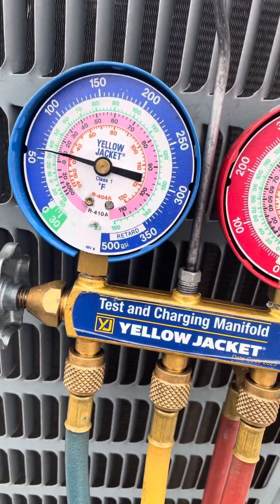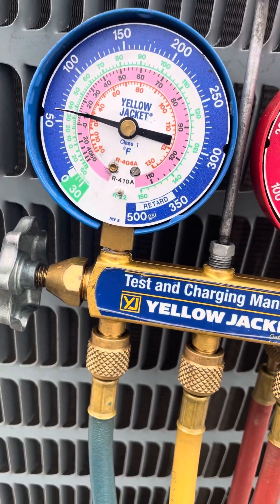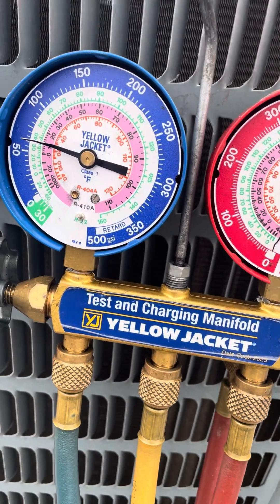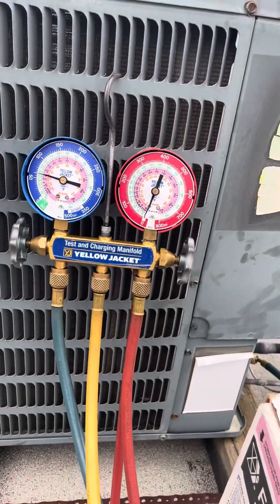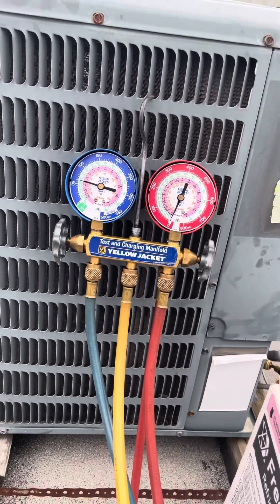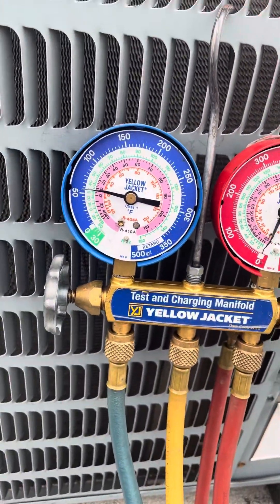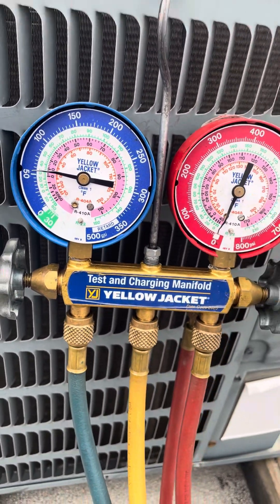You really want to have about 125 PSI on the blue side, and about 40 on the pink side. So if you want to get technical, about 40 on the pink side and about 125 on the blue. The customer says the AC is not cooling, not getting cold, so we're going to charge this up. You need your pressure at least about 125, or a good 40 on the pink side.